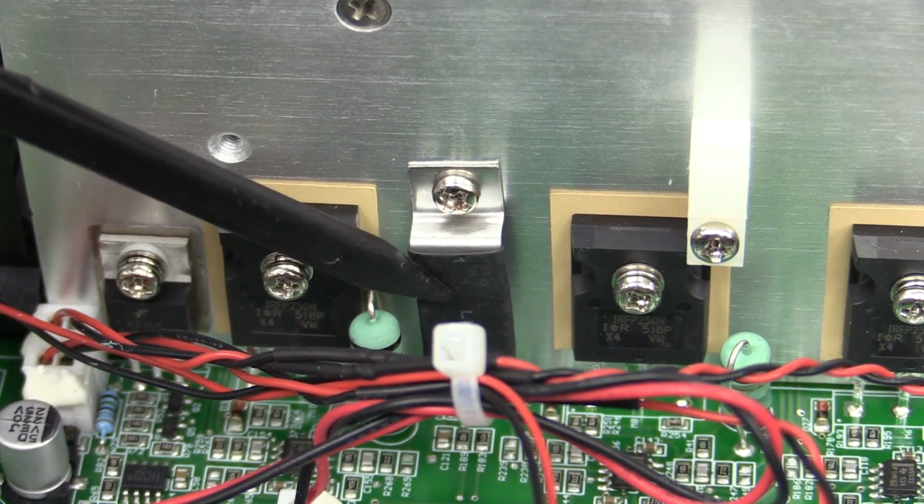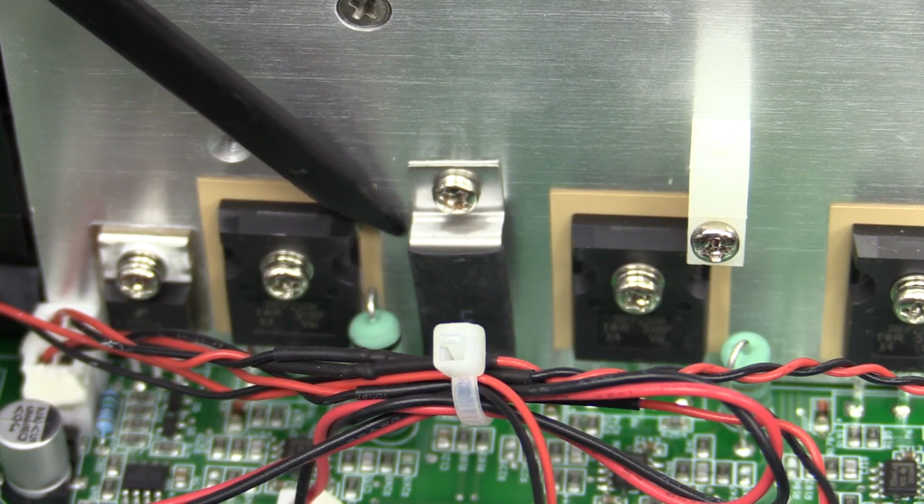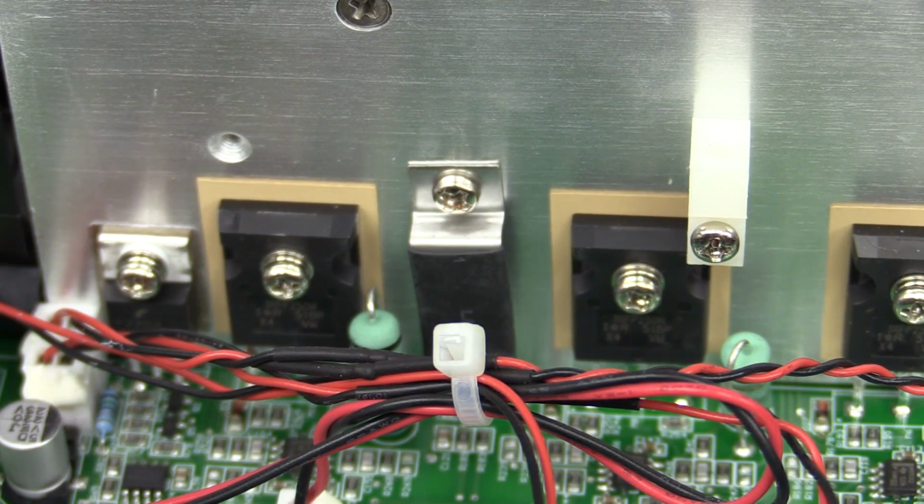That's what they're doing there with that bracket. They're just holding a TO92 package temperature sensor straight onto the heatsink there. They only need to do it on one side. They don't need to do it on the other side for the power transistors, because the thermal resistance of a big aluminium heatsink like this is bugger all.